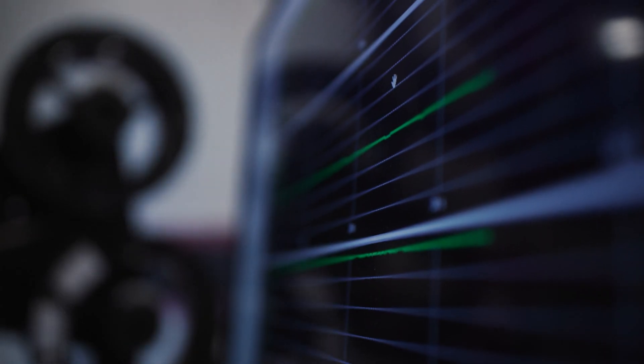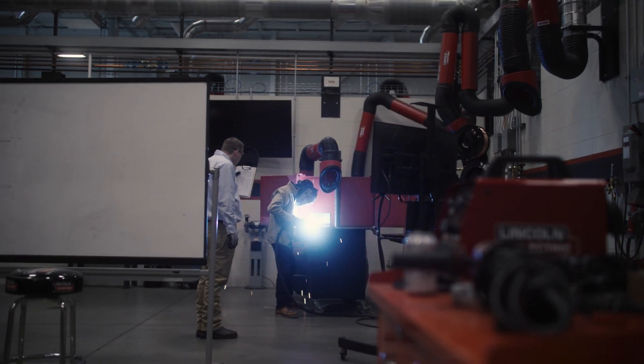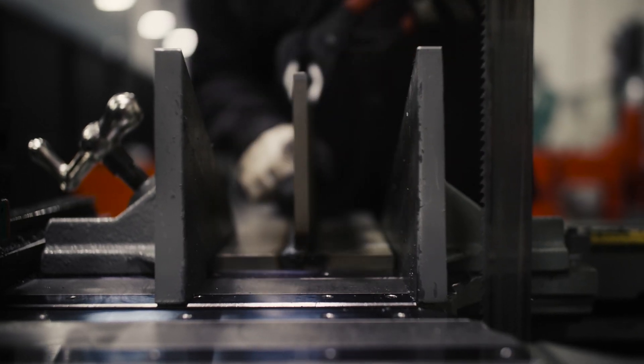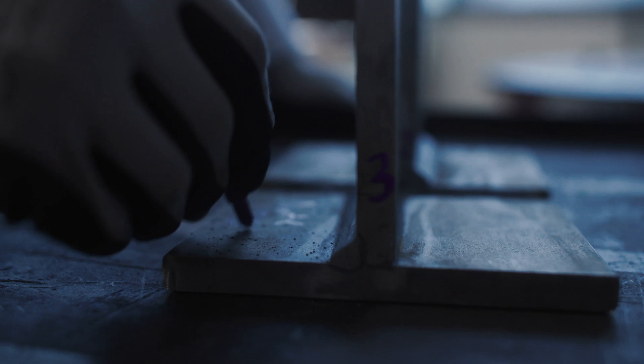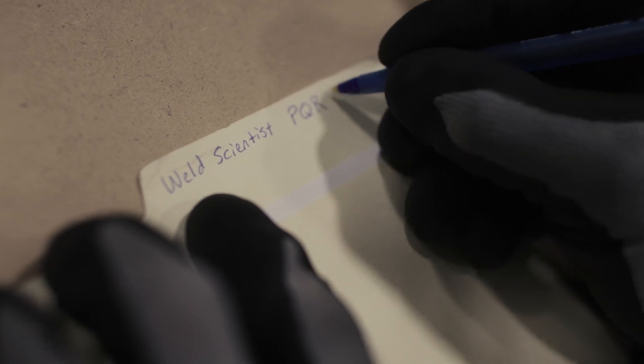After we realized that we had sound settings, I documented everything. A procedure qualification record is not going to have a range — it's going to be your exact settings of what you did. We've got to see if we actually passed — this is the fun part. When we were actually able to validate the procedure, it was a couple macros. It should be encouraging to people, especially with a process like hyperfill, because it can throw out those rotten bananas. If you're asking, 'Can I do this? Is this good to do?' — just do a PQR, qualify the procedure, and validate that these exact parameters are going to work.